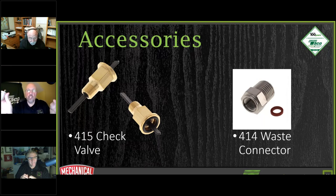After the first year, when you come back and do some service, clean the boiler, whatever, make sure everything is good, my suggestion is maybe closing them. I know a lot of people, probably half the people on here, just freaked out. It comes to blows sometimes when I do this in a training class. I'm saying, close it. They're like, well, you can't get the air out. Where's it going? Let it stay in here.